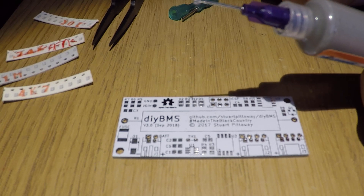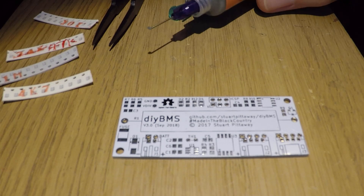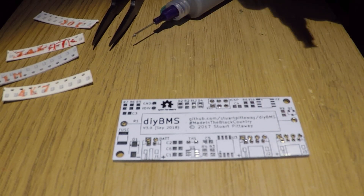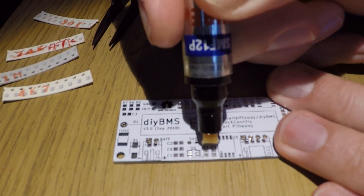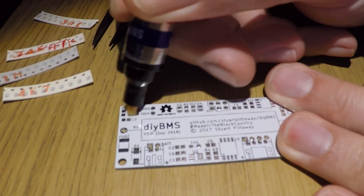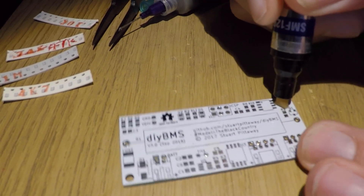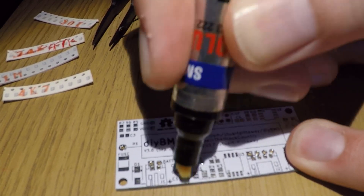You need a tiny little amount of paste on each of the pads. So what I'm also going to do is apply some flux to these boards — it generally cleans it all up and allows the components to stick. You only need to worry about the surface mount components on this at the moment. The other thing is not to get your fingers all over the board.